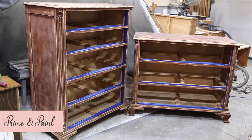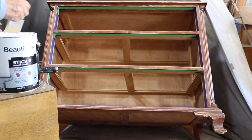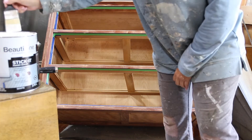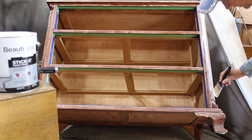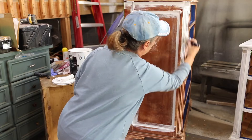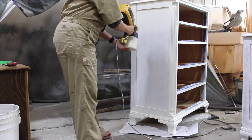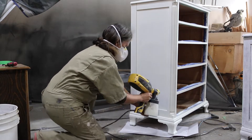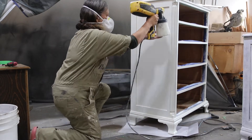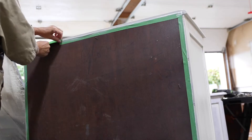Before priming and painting we always tape the insides of our drawer openings — this is an easy way to get crisp lines and give a more professional look. For this set we used Beauty Tone Stick It. It's better than a primer but also more expensive because it's an adhesive; it even says in the can that you don't have to sand, but we still like to do it anyway. We used a brush to get the Stick It into the corners and grooves, then a roller for easier coverage on the flat areas, and repeated this process for the tall boy as well. We used our Wagner Flexio sprayer to paint three coats of Beauty Tone cabinet and furniture paint in the color new cream. It gives a smoother finish without brush strokes or roller dimples. We remove the tape when the paint is still wet, pulling at a 45-degree angle to get crisp lines by avoiding smudging.